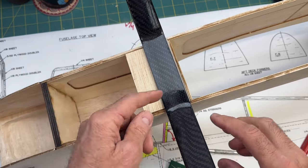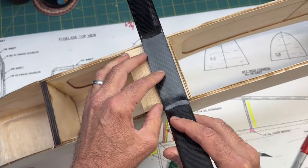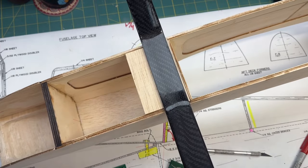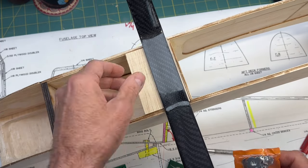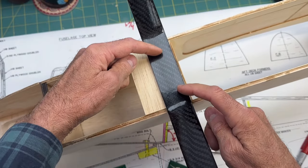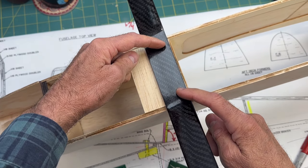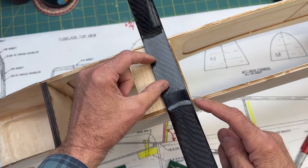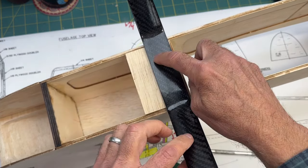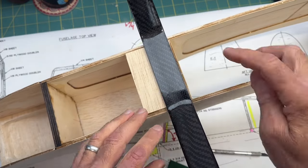And I realize it's off center from the plate, but that's just because it's up against this bulkhead here. But I don't have a problem with that. That's fine. And it's going to go like this. What I realized though, so what I want to do, as I mentioned before, is put two bolts on one side as far out as I can go, and then another set on this side, and offset them so that I can distribute the force, if you will, along the base plate here.